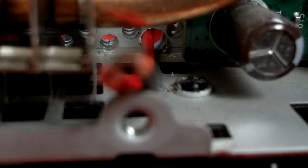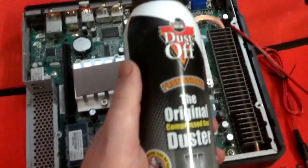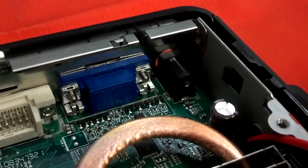That's good. You can see that slightly larger hole there - that's just what I'm looking for. Now this wire should go through there real easily. I got the wire pulled through there. Used a little bit of duster to make sure there weren't any chips or anything in there that could make some contact. So what I'm going to do now is heat up the soldering iron and get on that jack.